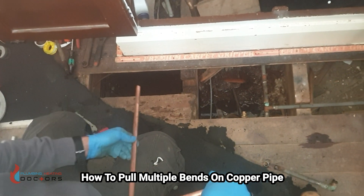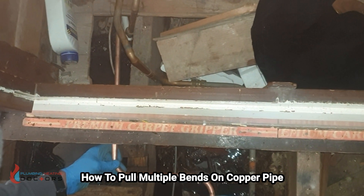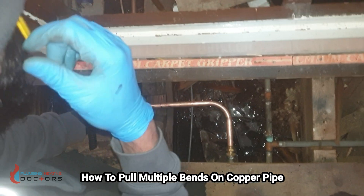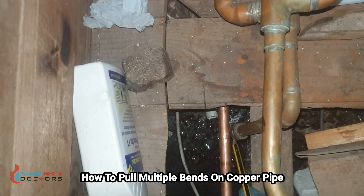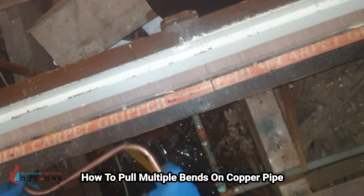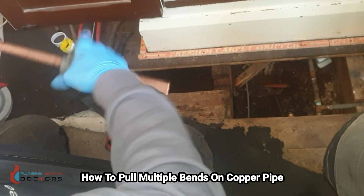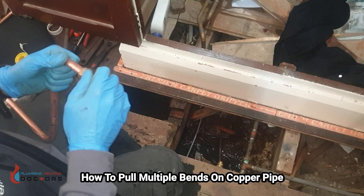Because it's actually shorter I can double-check by putting it in there. I can put it to where I want it, into the actual compression joint, and you can see right there — the mark I've made lines up with this pipe. That should be bang on. Let's take this back out and cut it. Moment of truth — let's see if it's worked.